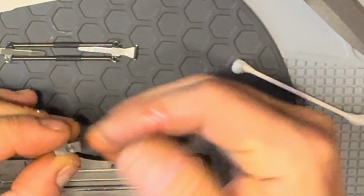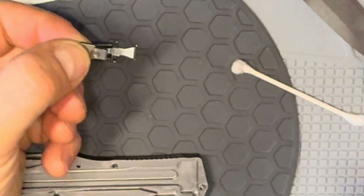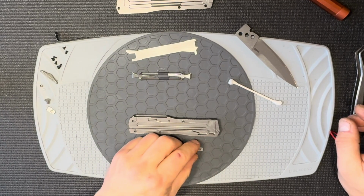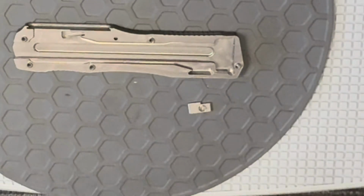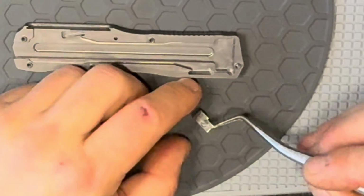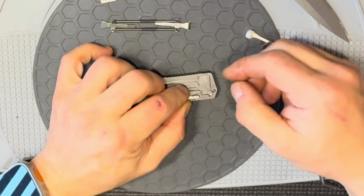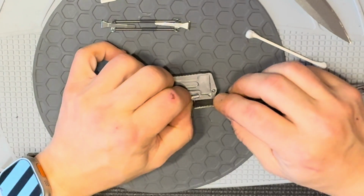Start reassembly by placing the conical spring into the detent on the locking gate plate. This step requires absolute concentration, some dexterity, and patience. Notice the plate's orientation. The side with a cutout goes upward into the frame. Installing the rear locking gate is just a little bit easier than installing the front one due to how the frame is shaped around that area.